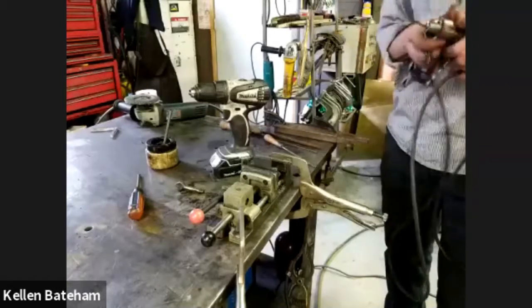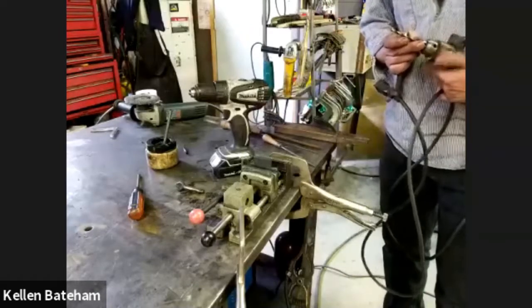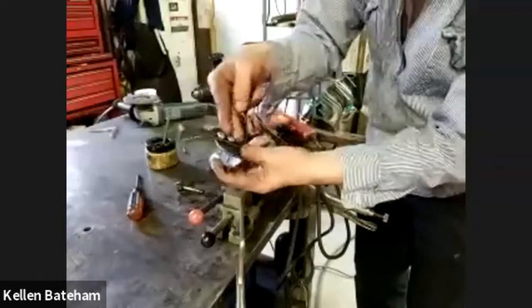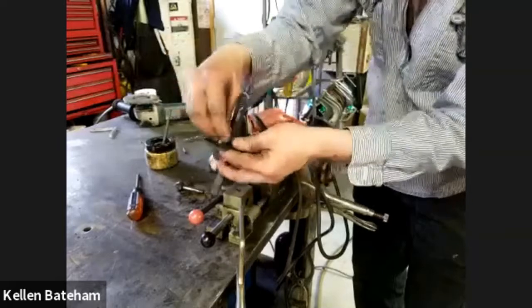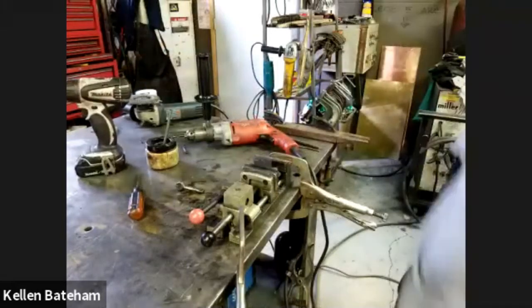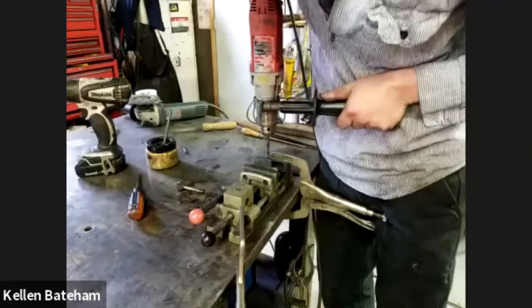Could you restate what you're currently doing right now with that subpar and now appropriately pared tool? I am drilling holes. I'm drilling these 3 holes. I'm gonna pull my mock-up here. So it's the 2 holes that'll hold the adjustable piece on and the hole on the bottom. And I believe it's 13/64, which is the size that you need to drill if you want to tap a 1/4-20 hole, which is the size that my tripod has on it, and I had a bunch of 1/4-20 fasteners.